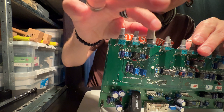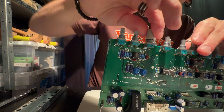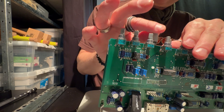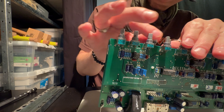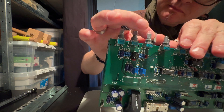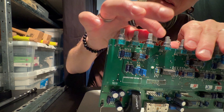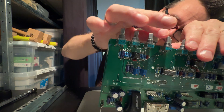We're making a combination of small twists and turns and the full movement. Just by the feeling I can tell that the deoxit is finding its way down into the potentiometers, even though the potentiometer is sealed. Sealed potentiometers must overall be a good thing since they protect from dust and dirt, and yet it's still possible to clean them with the deoxit. It's fantastic.